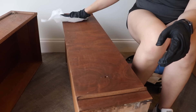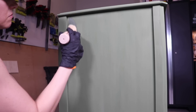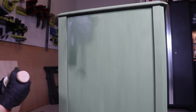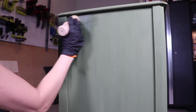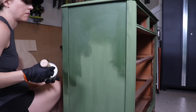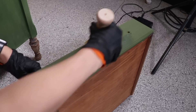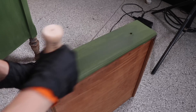I let the dark wax sit and soak into the wood for about 10 to 15 minutes, then came back with a lint-free cloth to wipe away the excess. Now that my paint is dry, I'm using the same soft wax but in the clear version to seal the paint. I really love sealing milk paint with soft wax or hemp oil because it's so absorbent and it just soaks into the paint and makes your piece look seamless. This clear wax does not dry white, so if you get it into any cracks and crevices you will not see a white cast. It does take a little elbow grease — you've got to work it in. I always separate colored wax brushes from clear so you're not contaminating your waxes.